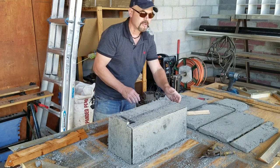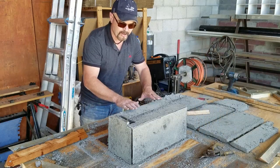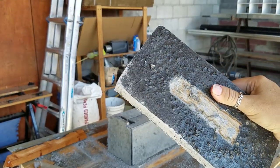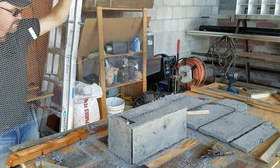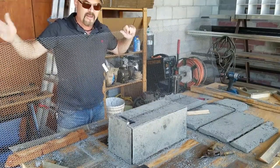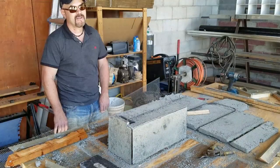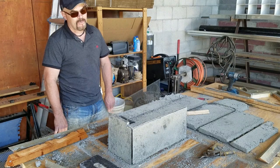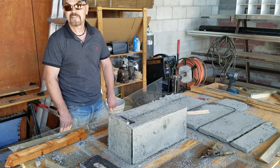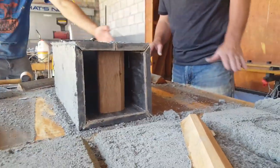It's going to be a wear surface that will just last forever. If I pour it on its own mesh — the expanded steel, just like I did but omitting the air crete — I'll use this expanded mesh, pour it on, roll it up, and there will be no split top. It will just be one box. I wouldn't want to fire it until it was a good two weeks old. I wouldn't do a split top — I'll do a solid, with all the panels as one piece.